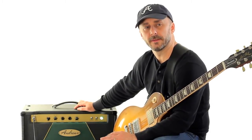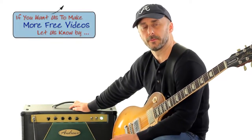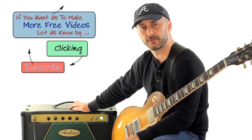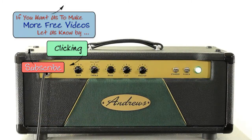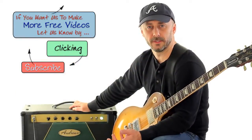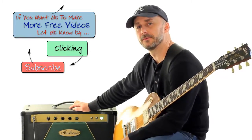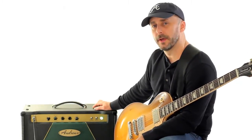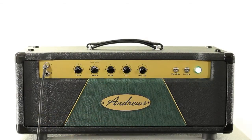And at higher gain settings, I found that it gave the amp a bit of a modified sound that was really cool for like hard rock. At lower or moderate gain settings, it'll give you a little bit more of like a Vox-like quality. Moving across, we get the bass control and then a cut control, which is like a presence control, and it affects how much of the overtone or harmonics that you get in the sound. It gives you a high treble impression, especially noticeable on your higher gain settings. And then finally we get a master volume control, and on the far right we get the standby and power switch and a very nifty green indicator light.